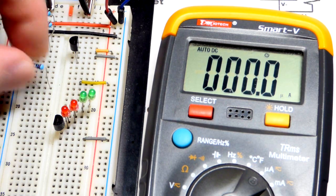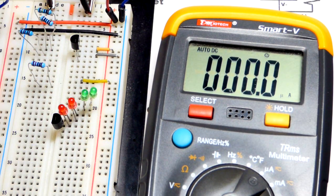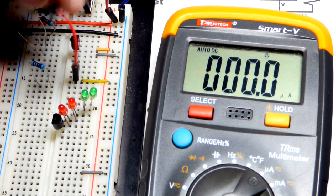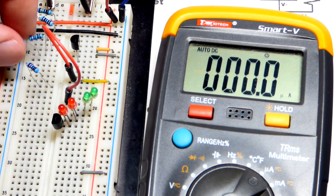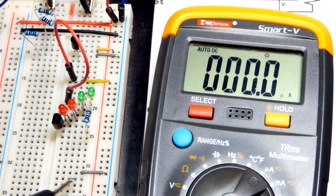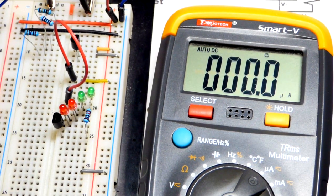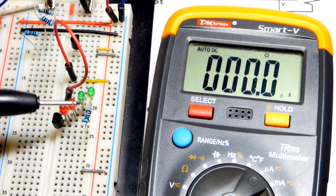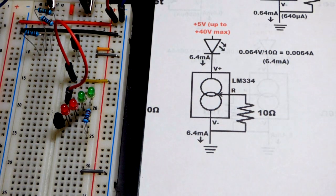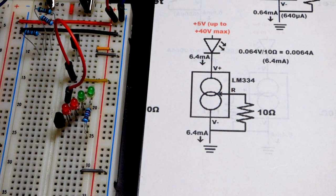We don't have to have the load on just one side. I'm going to move this jumper — the current will be on this side as well. Completing the circuit with the 10-kilohm resistor, the current is the same down here too: about 6.8 microamps. Everything in series has the same current going through it, so the resistor can be on the positive or negative side — whichever you want, or both.